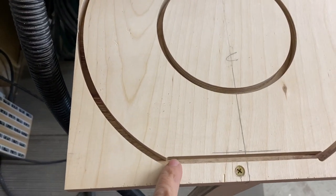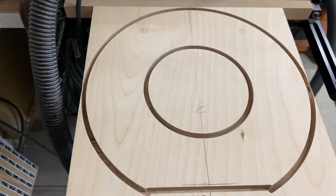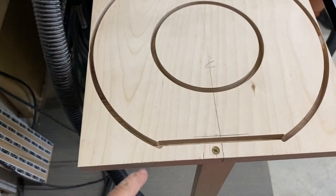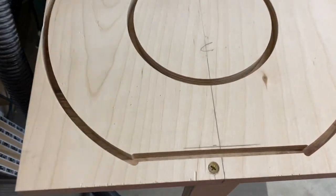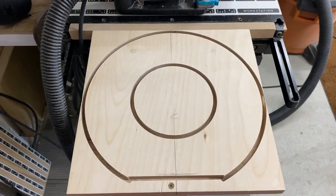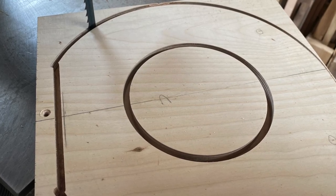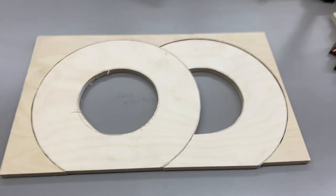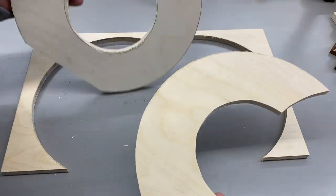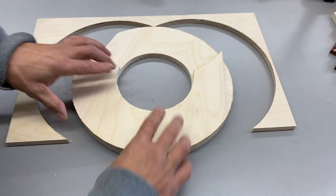See this little jog right there and right there? This was made in Shaper Labs, and I thought I had snapped this component to the circle, but looks like I missed a little bit — but no big shake for this project, absolutely does not matter. I'm cutting the pieces free at the bandsaw, and the reason I didn't plunge all the way through with the Shaper Origin is because this steady rest is going to be comprised of several layers, and so I'll stack them all up and then sand smooth the perimeter.